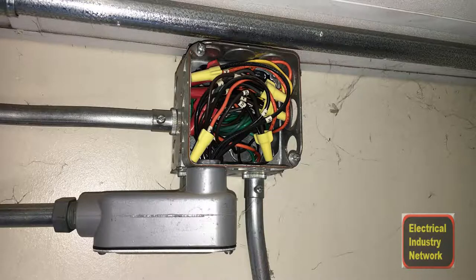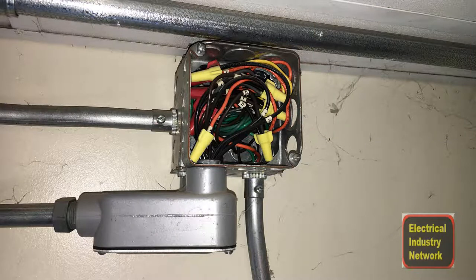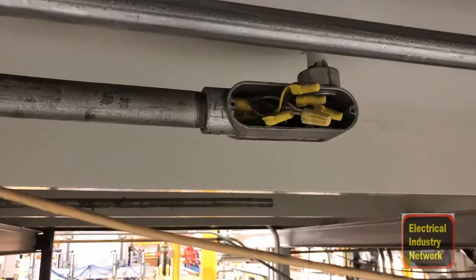On this one I was going to point out that it didn't have a KO seal in it, but that's not really the point here. This box is way overfilled. It's got an extension box, and then they used an LB to go up into the bottom of the extension box. Poor planning, adding work to a box that's existing on the wall. Probably the best thing in this scenario would have been to take that box apart and put in a six-by-six — whatever size per NEC that you need. That would clean it up a lot better instead of jamming all those wires in there. That's really borderline ridiculous.